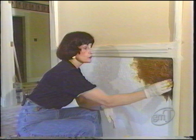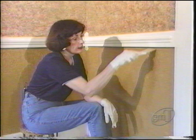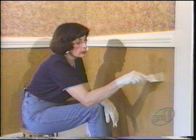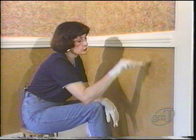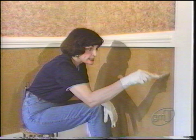When we get this completed, we're going to move to the next step and do some polyurethane — but this has to dry for 24 hours. We're ready now for our final coat: polyurethane, satin finish latex. Rub it on very gently, making sure that you cover it very well, but don't do it so thickly that you're going to end up with runs. Make sure you get all of that rubbed down carefully, but do it gently. You're still dealing with a very delicate paper, even though it's thick and heavily embossed.